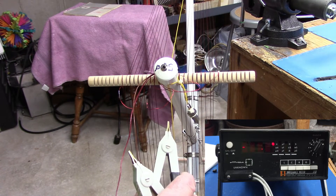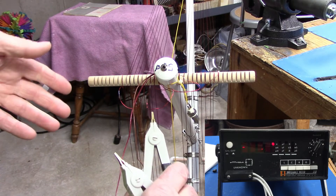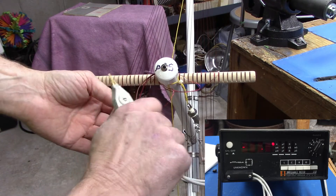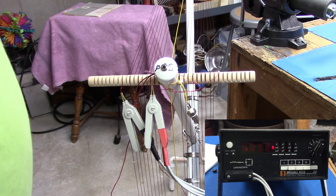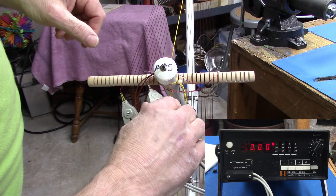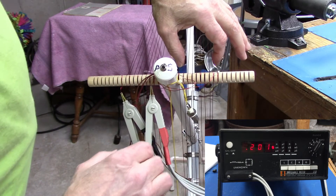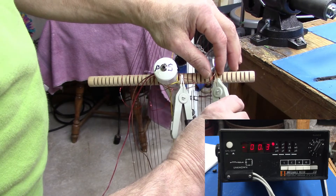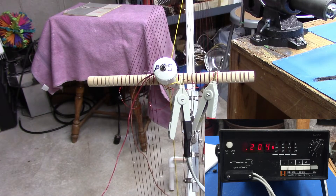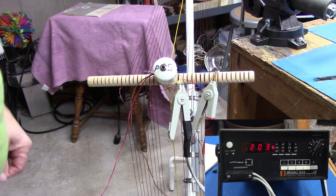Remember about the phasing when you put them in series — just like batteries. If you put them in backwards you get no voltage; in parallel you get twice the current; in series, twice the voltage. Polarity is sensitive here. Section one measures about 201 microhenries. Section two measures about 204 microhenries — and I can prove we're on that coil because squeezing those wires makes the reading go up.